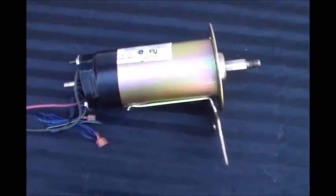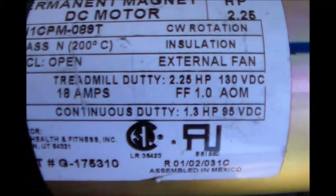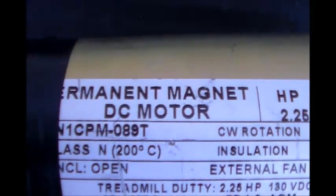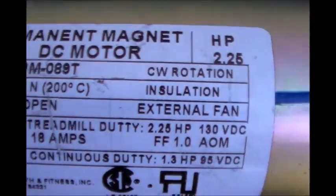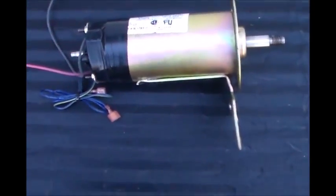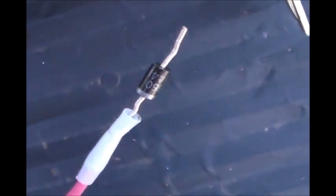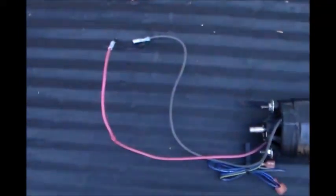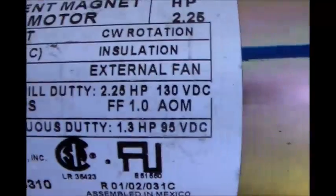Hey guys, it's Twinsville Soulful. I'm starting on a new project here. This is a treadmill motor I had for a while, one I used in my bicycle generator a couple of years ago. Let me read you the specs: it's a two and a quarter horsepower, 130 volt DC, 18 amp treadmill motor. It's also a permanent magnet DC motor, clockwise rotation. So pretty much when you spin this motor, it produces a DC voltage, DC power. Right here is just a small diode I'm using, which is not going to be permanent — not once I get the wind turbine fully assembled, because it will blow really easy. It can put out at most 18 amps at 130 volts DC.